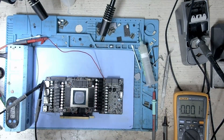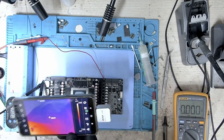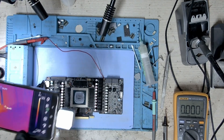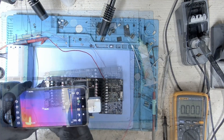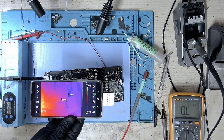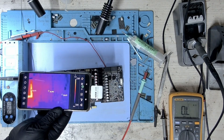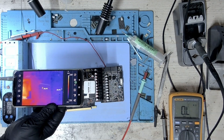Time for some voltage injection. I'm going to use 1 volt and 4.5 amps — let's see if it shows anything. Absolutely nothing. So I've increased the voltage to 5 volts. Turning it on — and there you go. It's the second MOSFET from the bottom.